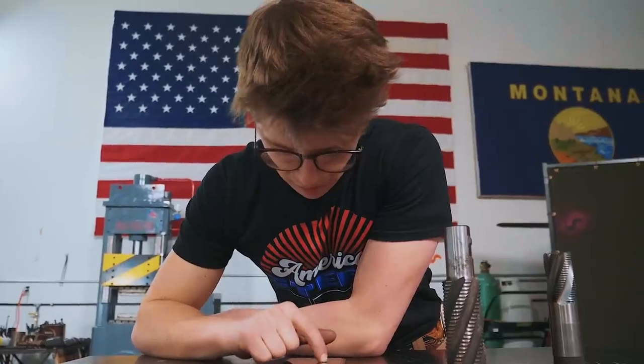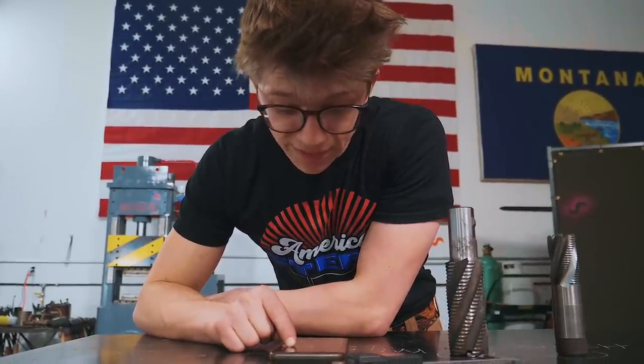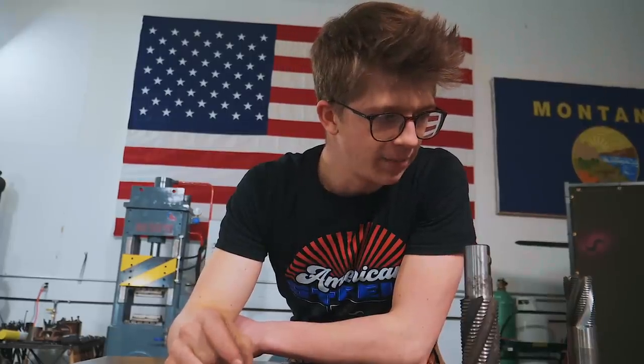I am looking at it some more. There's 0.35% silicon, 3.75% chromium, 9.5% molybdenum. Okay. Now that's a lot of alloying elements, and the more alloying elements you add into something, the little more foreign territory working it becomes.